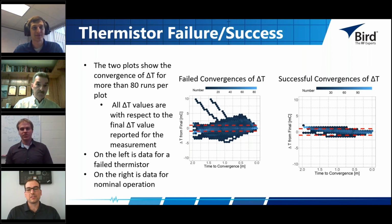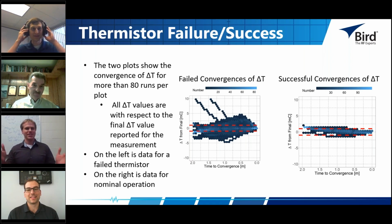So I think one thing to point out is actually, even in this failure, this calorimetric system was still performing better than the legacy one. It was about 0.17%. So I mean, this is the level of detail we're talking about here. And yeah, so as Jeff's saying, those red bars, that's 1 millidegree C. So that's 1/1000th of a degree Celsius. I don't think you or I could detect that very easily. I don't know if Tim, looking at this, could have read that off the thermometer gauge.